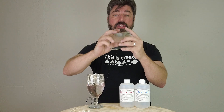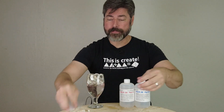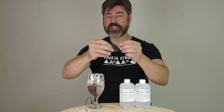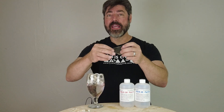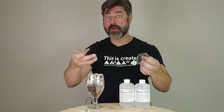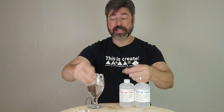This is what it looks like when it's cured. This is a fresh piece and it's actually going to get a little more brittle, but when it initially comes out of the mold it has a little bit of give, like a fairly soft silicone. As it reaches its full cured state it embrittles to a point where it can be easily broken. It doesn't shatter the way breakaway glass does, but it is excellent for simulating broken glass on the ground or for set dressing.